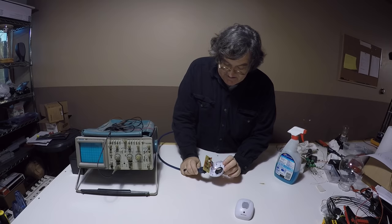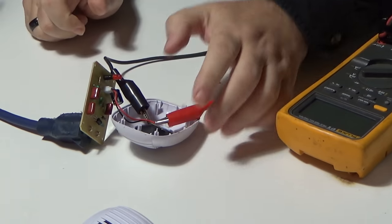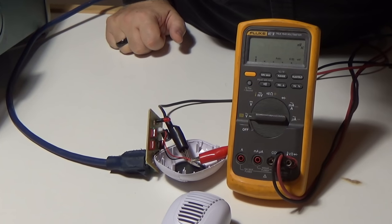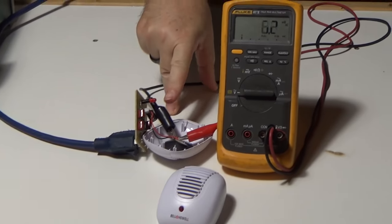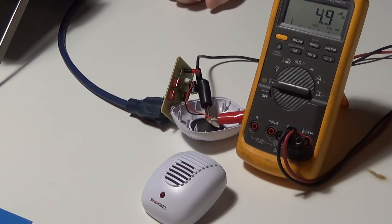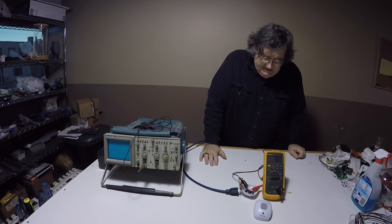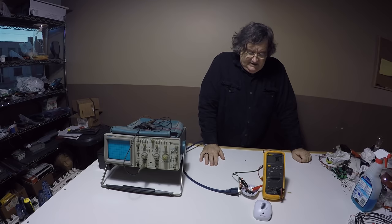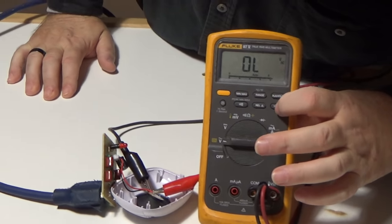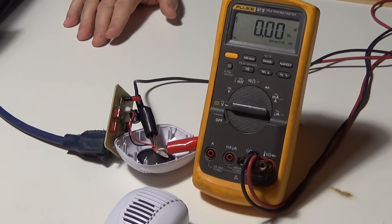I took some measurements and was surprised to see that virtually no voltage was coming to the speaker. Putting the output of the pest control up to the voltmeter, it is producing a little bit of voltage in the millivolt range. Part of that is because the speaker is tied to the LED, and the most voltage you can actually see out of this would be maybe a couple of volts — any more would damage the LED. Basically, the circuit really isn't producing anything of any significant output, and it is certainly not producing a frequency. Switching the measurement mode over — there it is — there's no actual frequency being outputted to the speaker.